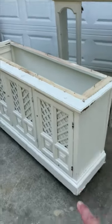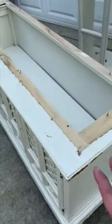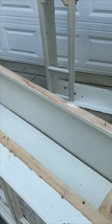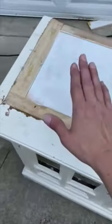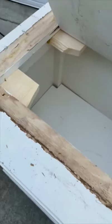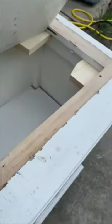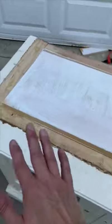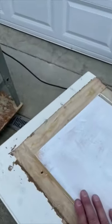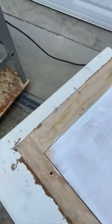I got the top piece off and now I've got this piece separate. Unfortunately this piece was attached to that and is not here, so this is going to need a new top. There was an insert put in here — it was open before. I put these little brackets in here, braces to hold it up, cut a new board to plop down in there. I'm just using some scrap I had. I'll paint this so I can fill it — no problem. This piece is going to go in there — nice tight fit.